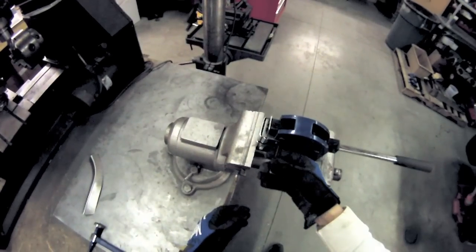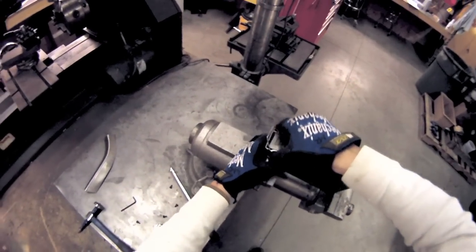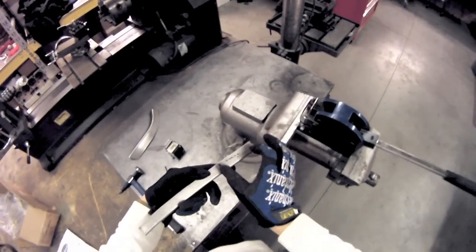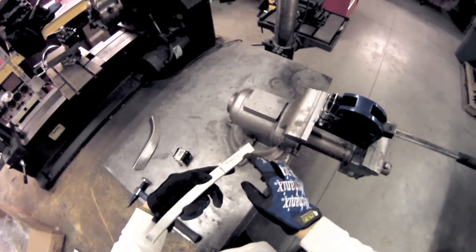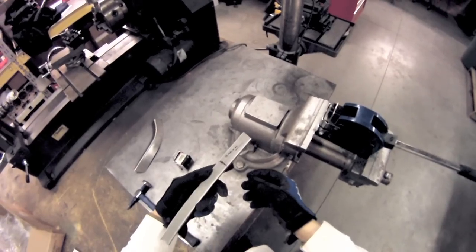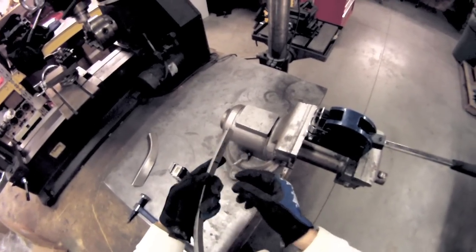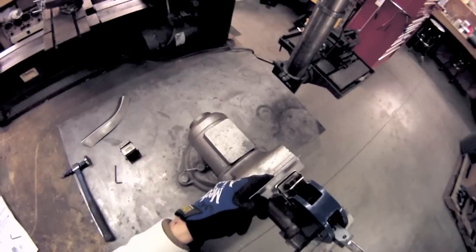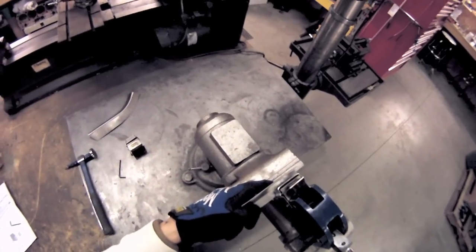Changing jaws is easy on this thing. Once you remove the allen bolts, remove the jaw, insert the shrinker jaw, and put your allen back in. This is the area I want to shrink right down there. I noted it because you can get moving along, hit the wrong spot, and now you've got yourself a nice candy cane or something not useful for what you need. Same thing — it doesn't take much to move metal.